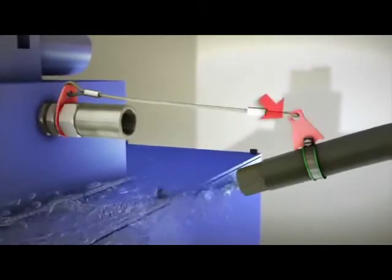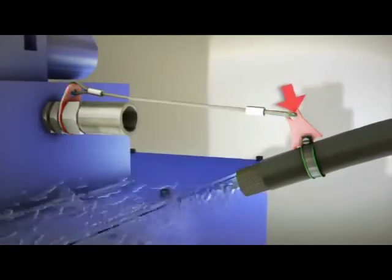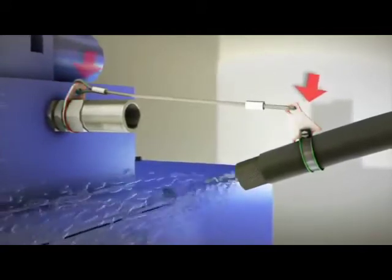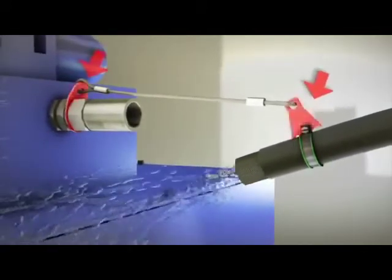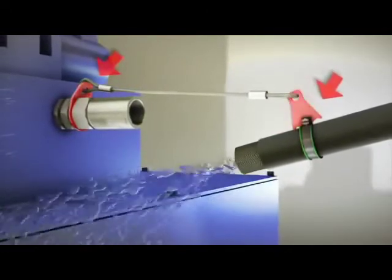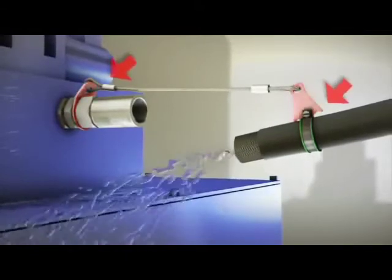The hose clamp and plate start to deform in turn, elastically absorbing the force released from the trajectory of the flexible hose. This is a critical phase which takes just a few fractions of a second to complete, and yet it is in these seconds that the system materials and components, previously sized and tested, arrest the dangerous trajectory of the flexible hose.